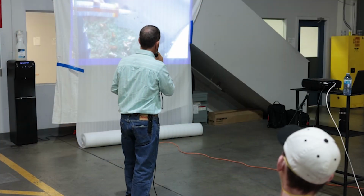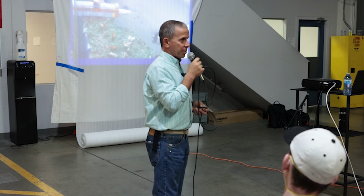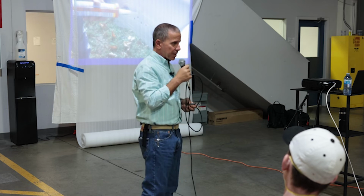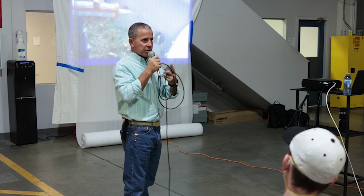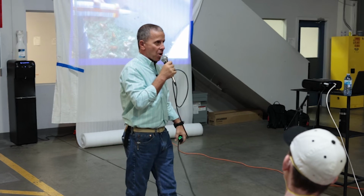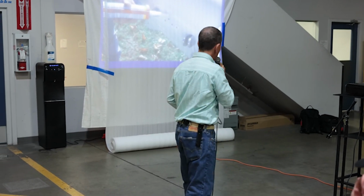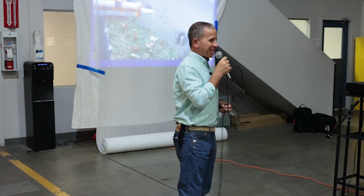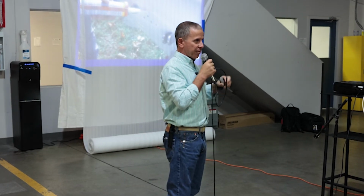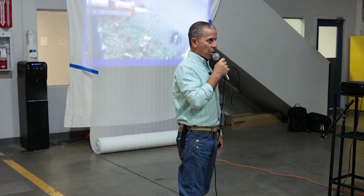So I think I said 95%, here it says 90, but the solution, the prevention, in the vast majority of these painted aluminum failure cases is really thorough bedding. And when I say thorough, I mean you need to get 100% squeeze out all the way around that flange. You need to have excess sealant. It seems wasteful, but it is the only way to know that we haven't left a void in any way around that flange. So don't be stingy with the sealant. Use lots of it, crank it down, get it to squeeze out completely around that flange, wipe it clean. Now you know you've got a good bead all the way around, or a fillet all the way around that flange, and water can't penetrate beneath it.